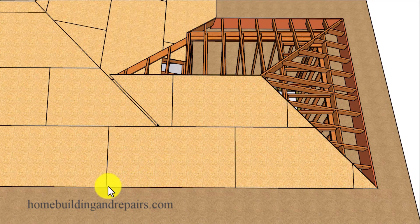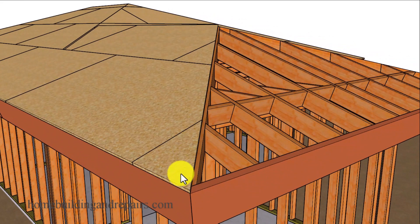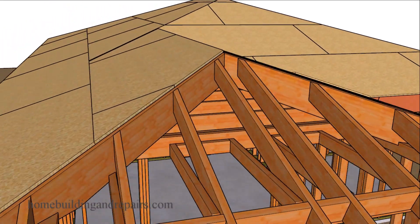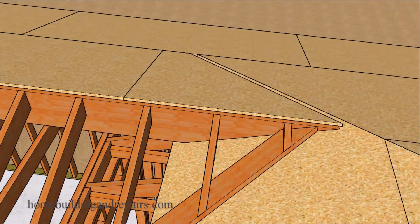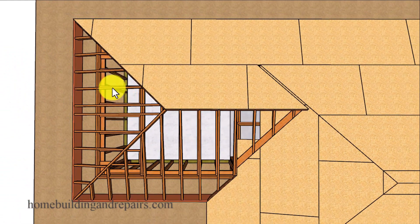Let's go ahead and install our roof sheathing. The sheathing can extend farther over this way and provide a nice structural tie between the room addition and the existing house. Keep in mind that some engineers call out on the plans minimum sizes of roof sheathing — 16 inches, 18 inches, or 24 inches — meaning a small piece might not work and would need to be verified with your local building authorities. If you live in an area where it snows, you might need a stronger roof with wider rafters — instead of a 2x6, you might need a 2x10 — and it might not be a bad idea to use structural hardware instead of pressure blocks.